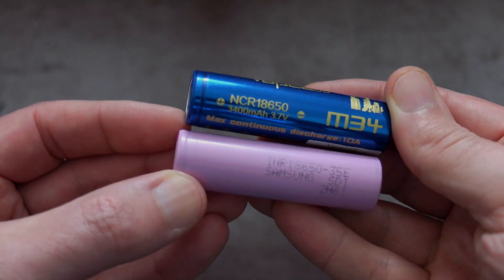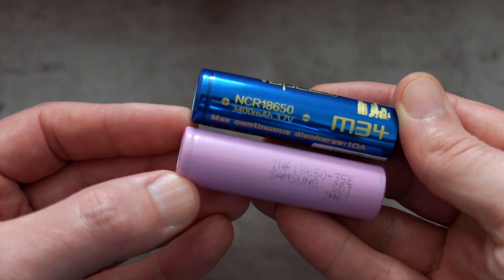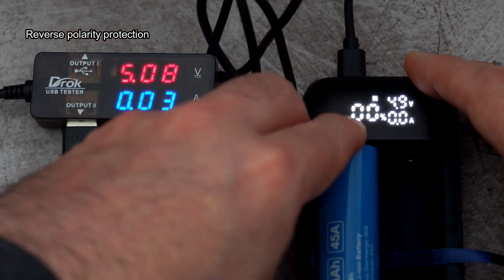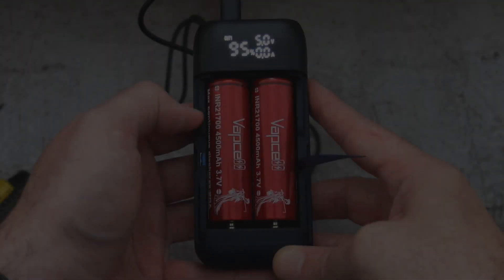As mentioned, a downside is that these higher capacity 18650 cells are really designed to be charged at around 1 amp for their best charging rate. You can charge them faster, but I generally use that rate to preserve battery life. As you'd expect, there is reverse polarity protection — if you put a cell in the wrong way around, nothing bad is going to happen.